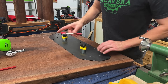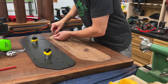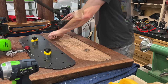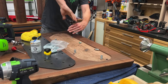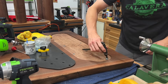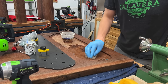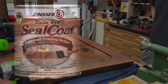And these strong magnets made by MagSwitch make it super easy to lift these heavy steel plates up and out of the recess without busting a fingernail. So with my mounting holes marked, I'm just using an awl here to mark the exact center for my drill bit to guide itself into. I'll get those all drilled out for the threaded inserts. And I'm also countersinking these holes so the threaded inserts sit flush or just below the surface. Now, these are different threaded inserts than I used on the other legs — I actually much prefer these. They're 5/16ths-18 by about 25 millimeters long, or just over almost an inch. And I did use a little bit of wax for lubrication as I screwed them in.